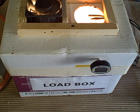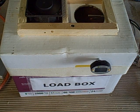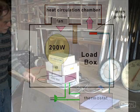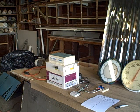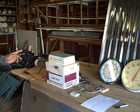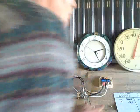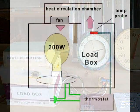So what we want to know right now is the length of time that the light comes on compared to the total time interval. The temperature inside our load box is stabilized at about 64 degrees — about 10 degrees higher than the ambient temperature. It's still off, just circulating air through the box. As soon as it comes on, we'll measure the length of time that it's on. The on time is 9 seconds and the total time between intervals is 135 seconds.